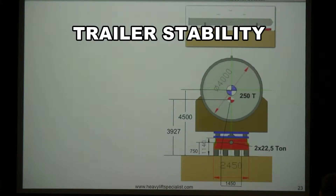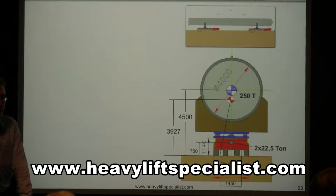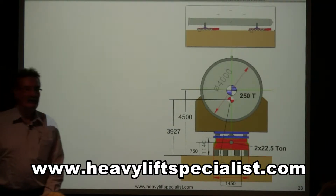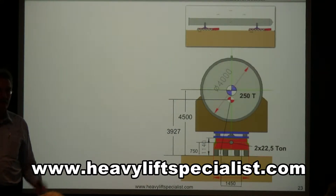One question: with three points versus four points — if I have an engine of 320 to 350 tons with a high center of gravity, and I have to move it on unstable ground, not on a highway but through a river or whatever, I put it on four points in order to have more stability? Yes. If you have a high center of gravity, use two or four points and carefully watch the manometers on your trailer.